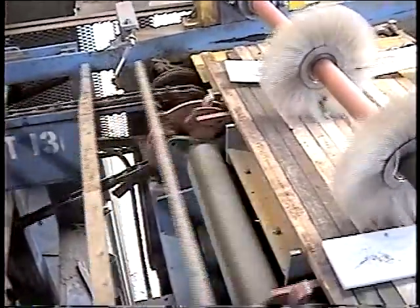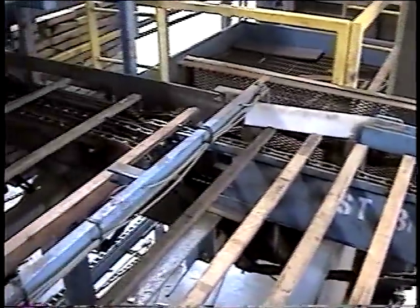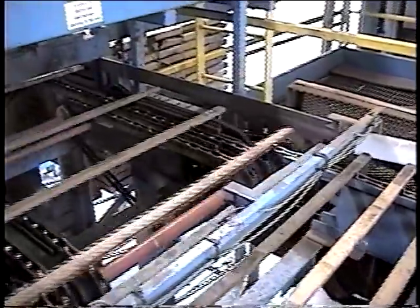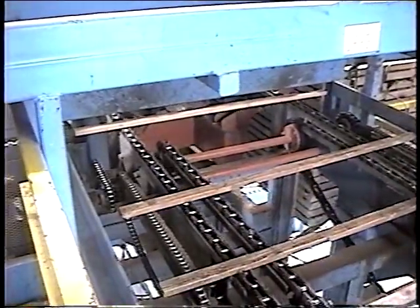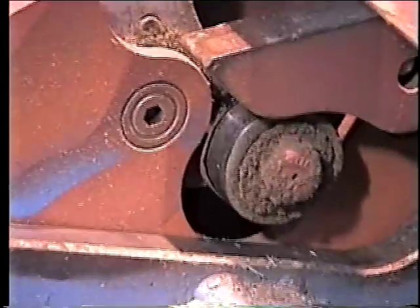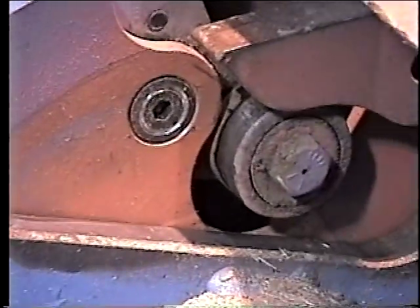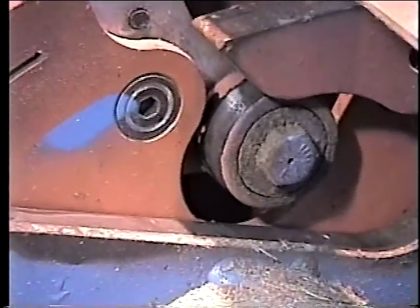With this design, longevity of the tong is greatly enhanced because the tong bolt cannot get out of alignment. For maintenance simplicity, the same size yoke roller is used for the tong pivot and the tong clamp action. Each yoke roller is greasable through a hole in the mounting bolts. The stationary cams for each star wheel and the rotating gate cam are made from T1 steel, which work-hardens to provide a long service life.